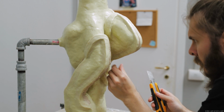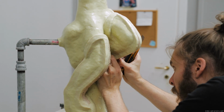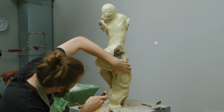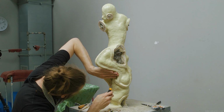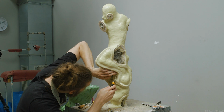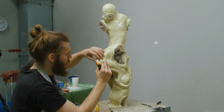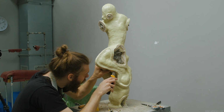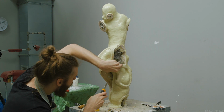It's essentially a blade with half a circle in the blade. When cutting with this blade, one side of the silicone gets the positive side of the half circle and the other will get the negative. This creates a groove running along the inside of the silicone walls, which will help the two silicone pieces align perfectly when you place them against each other. You will have to place them against each other when casting, of course.